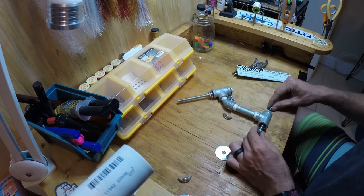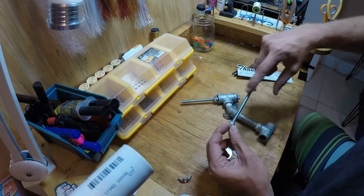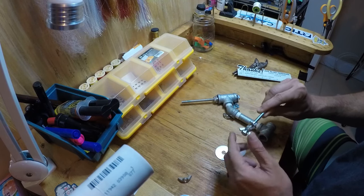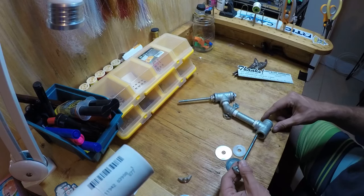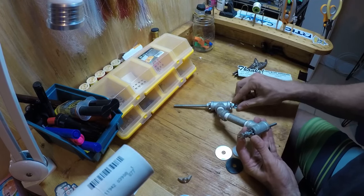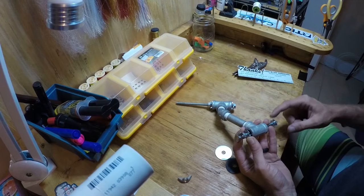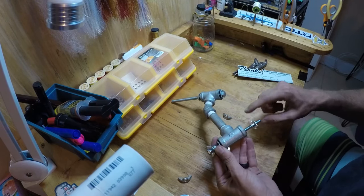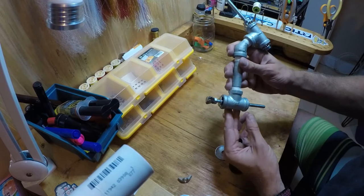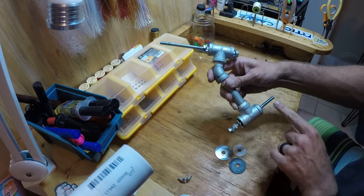But the idea is we're going to put it through this T, same as we did up here. So you thread this guy down, the little nut plate, all the way down towards the bottom, about there. You need to leave a little bit of space so that you have an adjustment for closing the jaws on the pliers. Basically, you fish that in there, and you can see the conical side fits right inside that hole and holds it concentric. Take your other one right here. Put the conical side in the opposite direction around the inside, and thread this down. When I thread it down, it basically centers it up, gives you a good center axis through that T, and then you can adjust back and forth with these. This is basically how I'm adjusting through to the pliers.